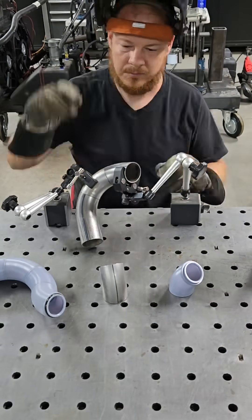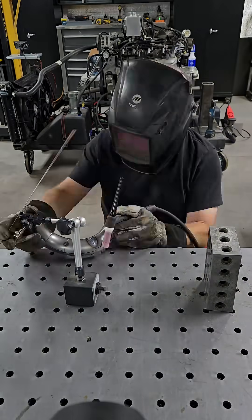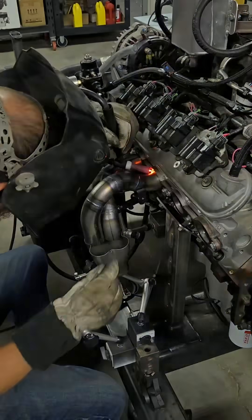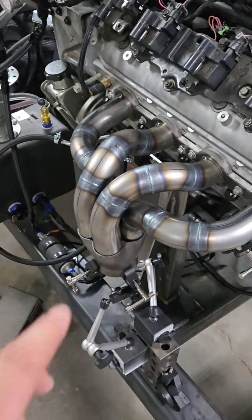You can see just how handy those universal tab positioners are — without them, this job would have been 10 times more difficult. Kevin busted out this whole entire set in less than a couple of hours. Weld it out as you see fit. Back purging is highly recommended for exotic materials. Fit it and tack it.